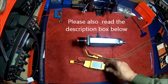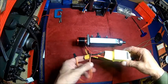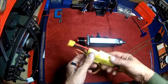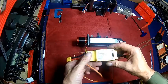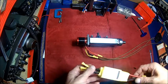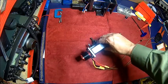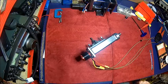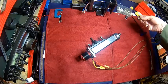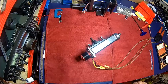Welcome back! Today we're going to talk about the electronics of the toolpost grinder, which is an ESC controller. If you look it up on the internet it's called VESC — I put a link in the description. It's used by the skateboard community for electric skateboards, and this thing is capable of 50 amps at about 60 volts. We already have one hooked up here. You can control it by a servo input or by software — there are various different ways of doing that.